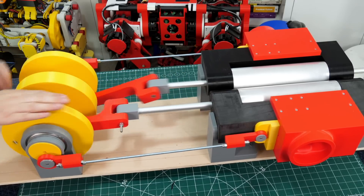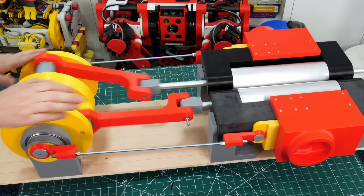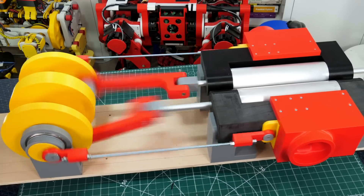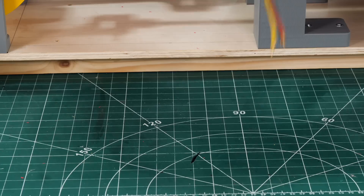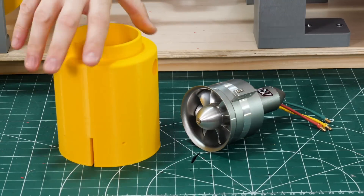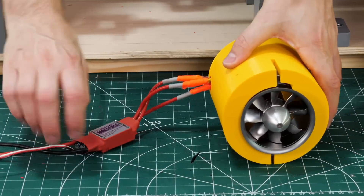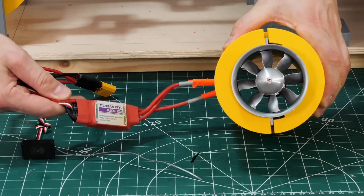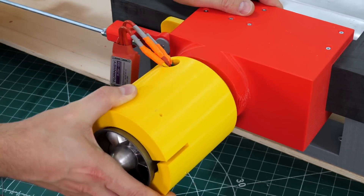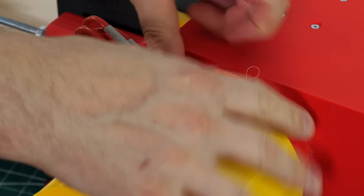Here's the whole thing in motion — we've got those two pistons 90 degrees out of phase and their two air valves 90 degrees out of phase with that, and the whole thing runs pretty freely, which is what we need for good motion. It's time for the EDFs. Those go into a 3D printed assembly — we've got a 100 amp ESC attached because the EDF is rated at 80 amps, and that fits into the huge air intake, although the actual surface area is less because the motor is stuck in the middle of the EDF.